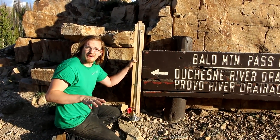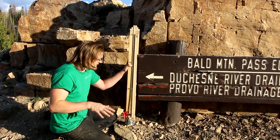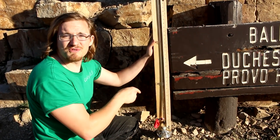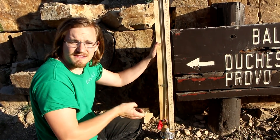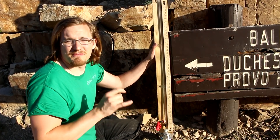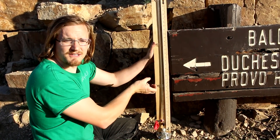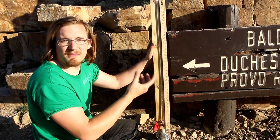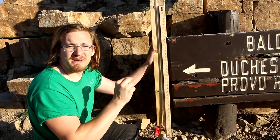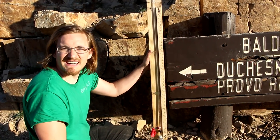Of course it is much colder up here than it was down in Salt Lake City — about 15 to 20 degrees Fahrenheit colder. Temperature makes a small difference to the barometer. Mercury, like most things, expands when heated, by one part in 10,000 per degree Fahrenheit. This means it will have contracted a little, been a little more dense — about two parts per thousand — so we'll have a shorter column, by about one millimeter.